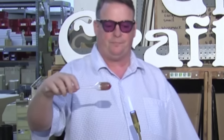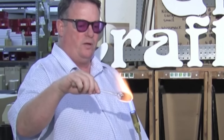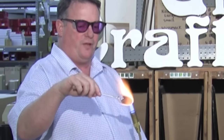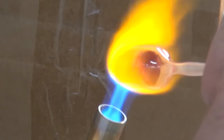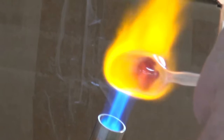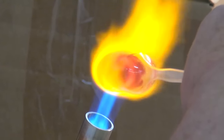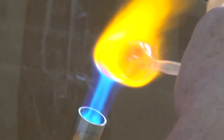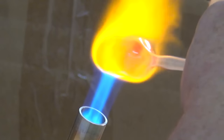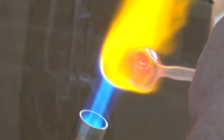So here's what it looks like now with the frit stuck on the inside. I'm going to come around to the front of the torch now, trying to get full use of the flame to heat the entire bulb until it's red and hot. The bulb will begin to shrink — it'll pull into itself and pull up against the shoulder on the back to take on kind of a little acorn shape as it heats.